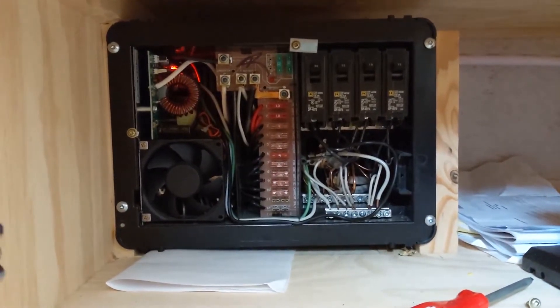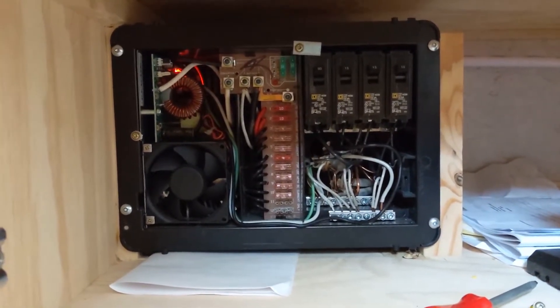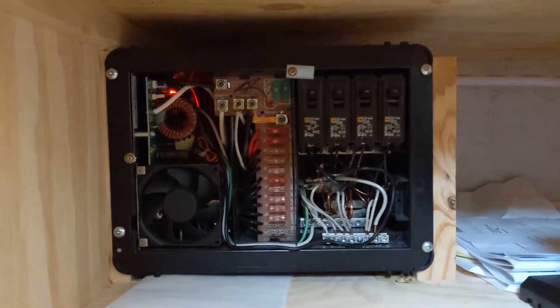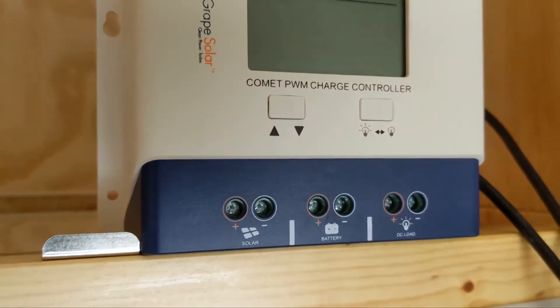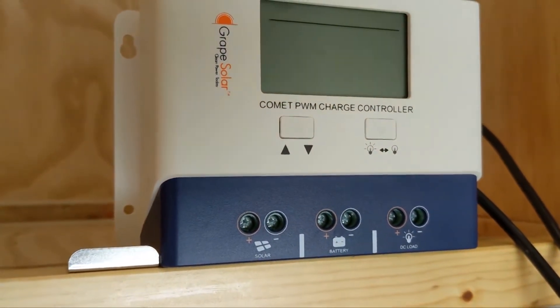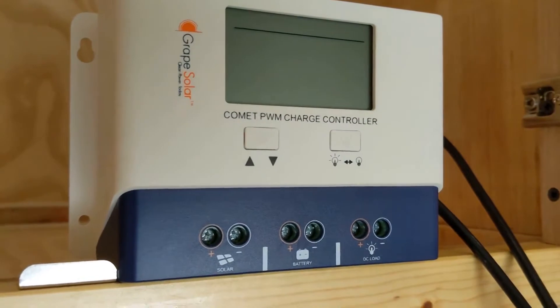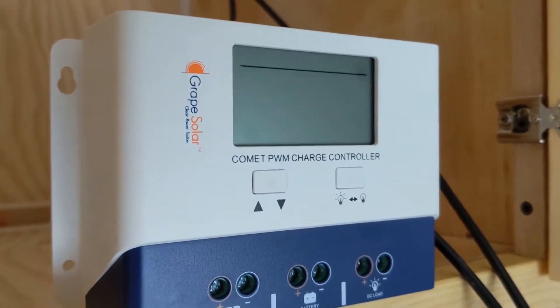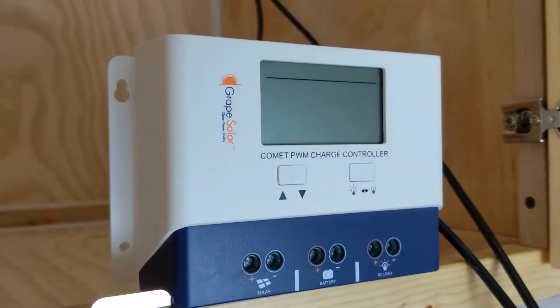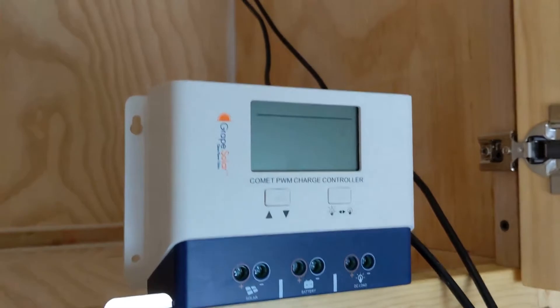What we're gonna do is hook the battery into the common lines that go between the battery and the existing controller. The wires that already go from the battery to here will get interrupted and go up to that charge controller. Whichever one feels like charging will charge — if solar is charging, the RV unit will wait. If it's dark and we're plugged in, the RV unit will take over and start charging the battery. The DC load terminals are for if you don't have an RV controller and you're running lights in a cabin or totally off-grid. Anyway, I think this charge controller is just ugly — it looks like it's from the 1920s.